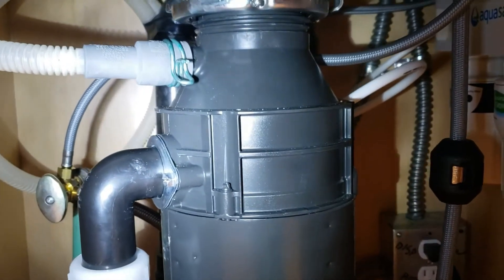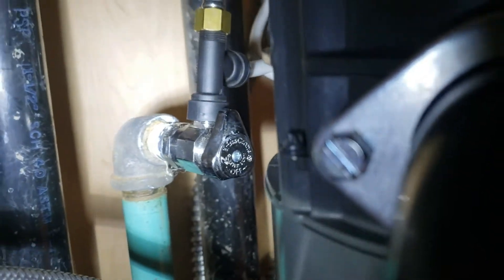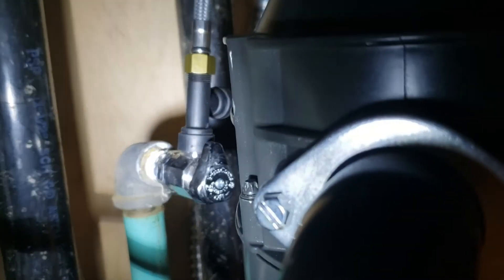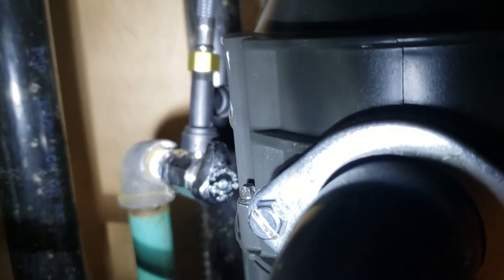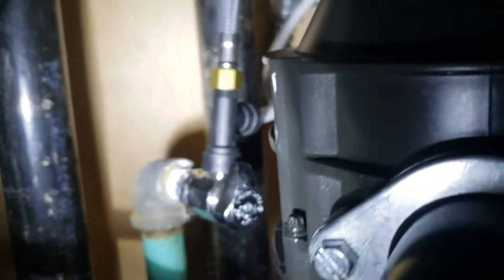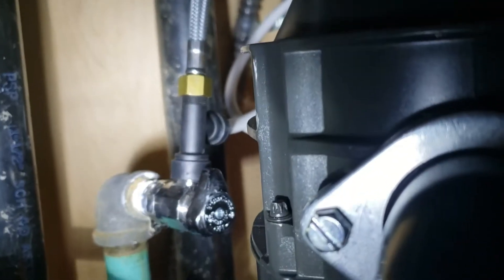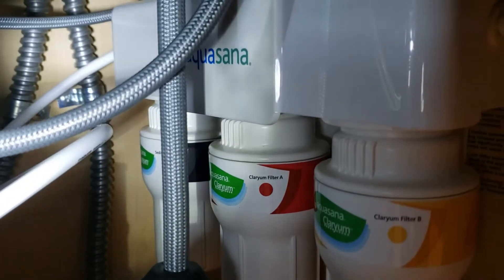The filter wrench is sitting on the bottom of the cabinet right there. We didn't touch anything else back here — garbage disposal and whatnot. We did have to give you a new shutoff valve right here; that old one would not shut down, which means to work on this sink you'd have to go out and shut the water off to the whole home every single time. Now it's a quarter-turn on, quarter-turn off. There's a T on top that connects the faucet going up, and out the side is the poly pipe going over to the filtration intake side.